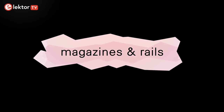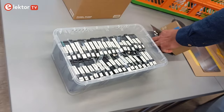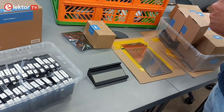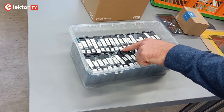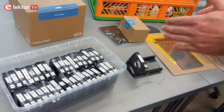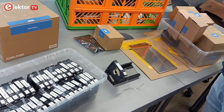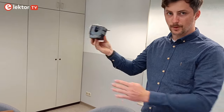Previously there was a growing box of component strips that was a nightmare to find parts in — hard to see what you already had. With this magazine rail system, you can see at a glance what you have. When starting a new project, you can easily see which components you already have and which ones you need to buy. For example, take a 100 nanofarad 0603 and put it onto the rail, assembling it as needed for a particular project. Labeling the rail and putting all needed components on it lets you put it on the shelf and swap between projects easily.